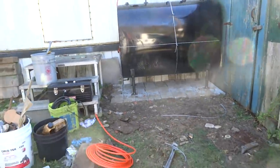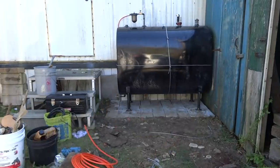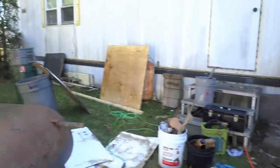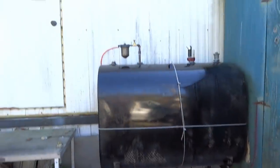I don't know if I'm a big fan of using the blocks, but I really didn't have any other choice. Would have been nice to put a nice slab there, but that guy can't be without heat. Let me go in and prime the furnace and change the nozzle and we should be good. I've got to hit the prime button and we'll see if we get oil flow.